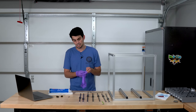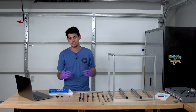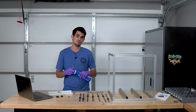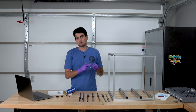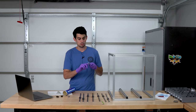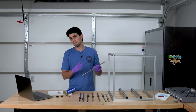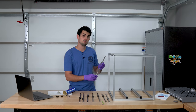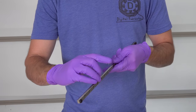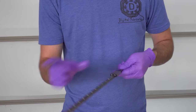A lot of people like to tout that linear guideways are more precise than aluminum extrusion motion systems like the V-Wheels. And yes, I would agree with that up until you mount those guideways onto an aluminum extrusion. The cross-sectional area of this mini guideway is so small that it will conform to whatever surface it's mounted to. So any twist in the aluminum extrusion will be translated to the rail. To combat this, it is advisable not to tighten these rails down too firmly to the extrusion in hopes they keep their original shape. However, the ideal option is to only mount linear rails to precision ground surfaces. Fortunately, aluminum extrusion is more than straight enough for the linear motion requirements of 3D printing.